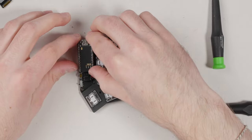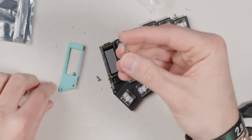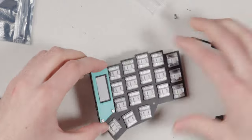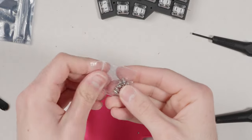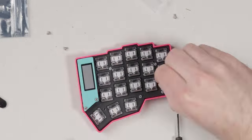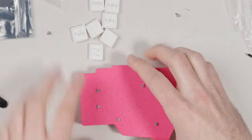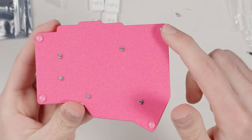Take the controller and mount it, then mount the display above it. Grab the cover with hardware and mount the standoffs to the board: flip it over, put a screw in, add the standoff, then attach the cover. Screws don't need to be super tight, just enough to hold. Grab the case and use the smaller standoffs from the other hardware bag to do the same process. Then add keycaps. Finally, flip it over and press the rubber feet into the four corners.